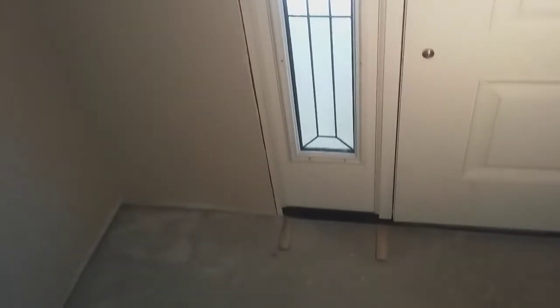And here now you can see my door's flush. It's all flush with the sheetrock on the inside of the house. Even on this side over here, it's all flush with the sheetrock so that we can just run our trim on the door. Again, I will cut these shims off and have our trim just cover the perimeter of the door.